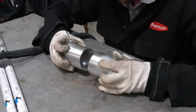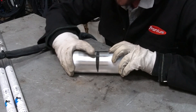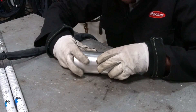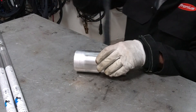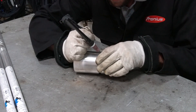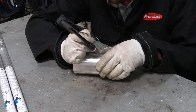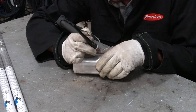This should go without saying, but make sure your pieces are nice and clean and prepped — brush clean with some acetone, or if you just want to weld with the mill finish, straight up clean with acetone. Either way, we've got to tack these together and get them fit so they're in the same place. There's no way to bridge that big giant gap without it being held together, so we need to set it all up and get it tacked.